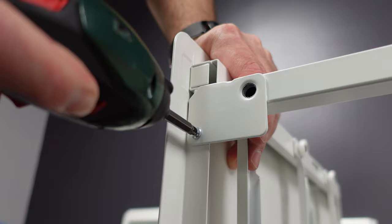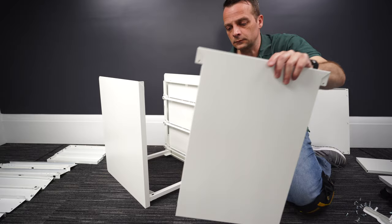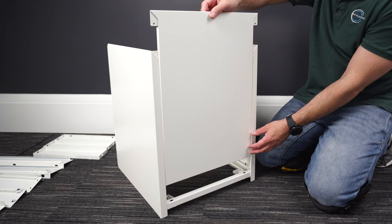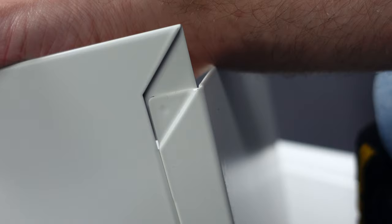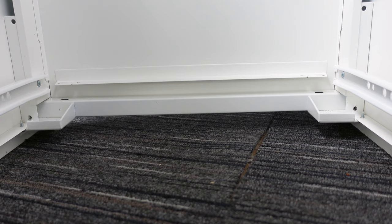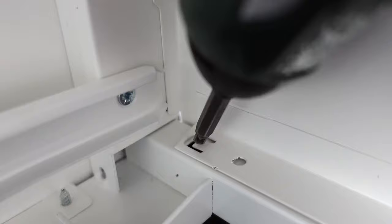You can see the entrance on the top of the wheel — this is the front of the rail and this is the back of the rail. Back panel comes in this way. Position it exactly the same as I have it here. There is a cutout on the back panel on the top, and they're gonna slide in nicely into the cutouts in the side panels. The left and right on the top come nicely together on one side, and exactly the same on the other side — that's how you secure the back panel with the side panels on top. At the bottom it comes in this way. Once you're in, secure it on each side by bending this locking system down on one side, and bending it on the other side as well so it locks the back panel in.